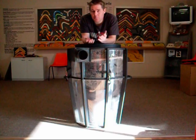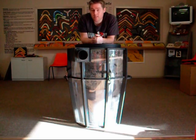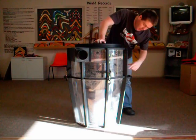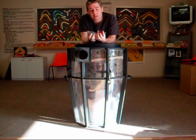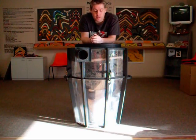Weighing up exactly what size to make each bin will depend on what you're going to be attaching it to. This unit is going to get attached to my existing dust extractor, so the hoses are around four inch to connect to the dust extractor. Another flaw of this design is seals — if you don't get a good seal on that inner bin, you're going to be sucking air in from below the cyclones, the air will go straight up through the cyclones, and you won't get the effective swirling motion needed. A lot of that fine dust will just go straight past, so your seals need to be very good to make sure separation works properly.